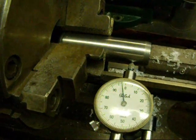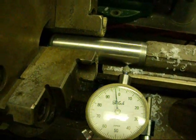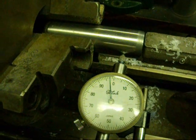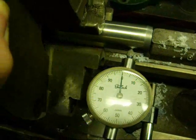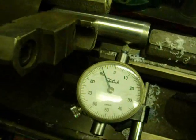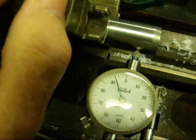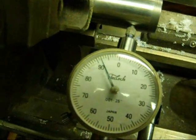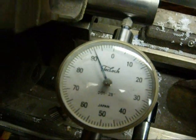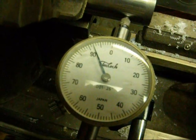I'm back at the Clausing lathe now and I have mounted and tightened down a piece of ground stock — actually it's a ground dowel pin about one inch in diameter — so that's very accurate and we don't have to worry about it giving us a misleading reading. I've got the dial indicator on there, and as I turn the work, you're going to see that we have approximately ten thousandths of runout. This chuck has been around a while, it's not a very accurate chuck, and it's really just for roughing work.